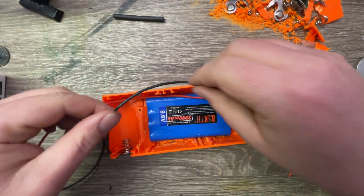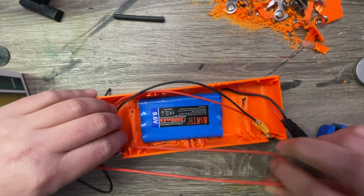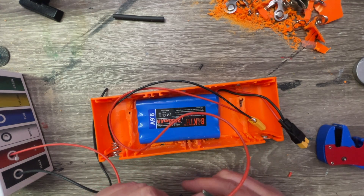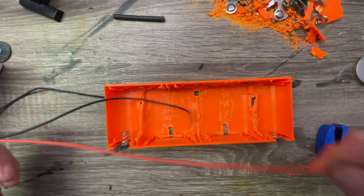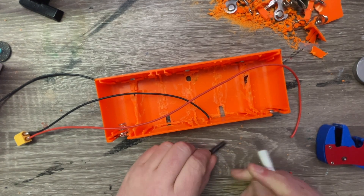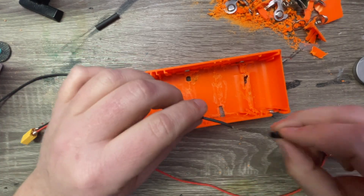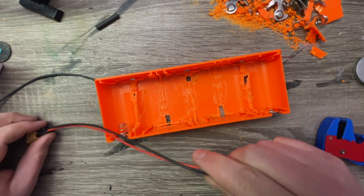So we'll do that — that will go on to there. And for this one, I want these to be somewhat even. I'm probably going to hot glue this along the side here so it feels like the cords are coming out of one spot, just for cleanliness. I'll do that to give plenty of room. Let's do our negative first. Before we get too far along and forget, we're going to put some shrink over the leads here — the wires — because if we don't put shrink on now, we may never remember to. That'll be so much cleaner. We will hit that with the heat gun after.